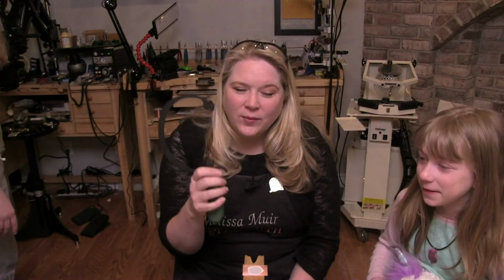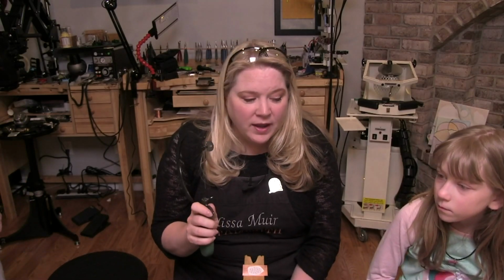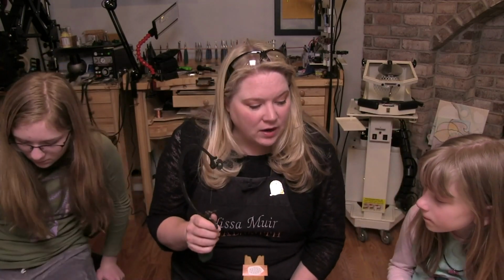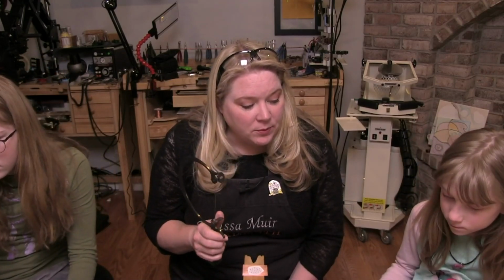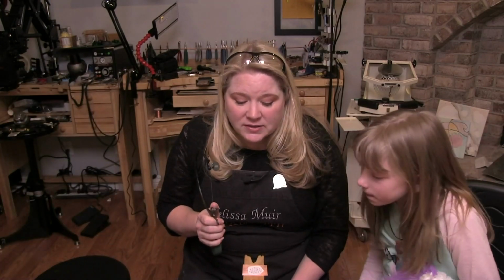You have a lot of different brands out there. I have a couple here that I'm going to be testing out in my studio this week. Some are from Glardon Vallorbe, and I also have some Super Pikes from Grobet, which are made in Switzerland. So they're really nice. The Swiss and German blades tend to be really good. You want to be very careful with some of the off-label brands. It's going to have to be a test. You have to decide what you have and then try a few packs out. It's going to cost you a little bit of money, but you'll really start to figure out what works best for you.